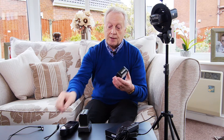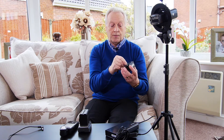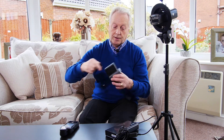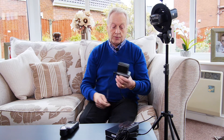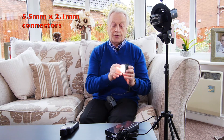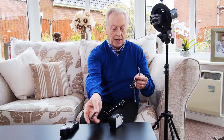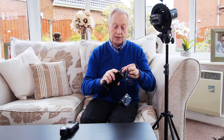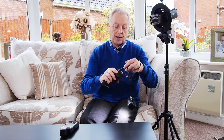With this simple cable, which just plugs onto the pins of the unit and provides the 9 volt input, just plug that in place like so. Then we can provide power to the unit either from the battery plate using the 5.5 by 1 millimeter cable connecting to the inline female socket — and there we can see the 8.4 volts going from this battery to the LED light, you can see it's quite bright. Alternatively, you can power the unit from a USB power bank: plug the 5.5 millimeter by 1 millimeter plug into the socket, plug the USB step-up converter into the power bank, and now we're running the light from the 5 volt to 9 volt step-up converter.